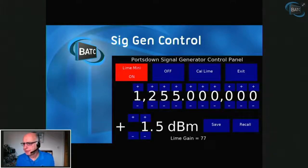Looking at the signal generator screen: once you get into signal generator control, there's an on/off toggle button at top left. There's a calibrate switch — you can't turn the Lime on until you have calibrated it first. The frequency display lets you toggle each digit up and down, great for stepping through a filter response in 10 MHz or 1 MHz steps. At the bottom you can adjust the level using coarse and fine steps, using the internal attenuators in whatever device you're driving. It gives a rough indication in dBm of output power, so you know roughly what your drive level is.